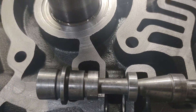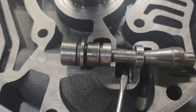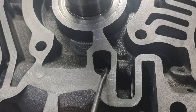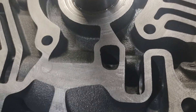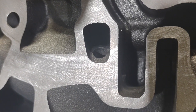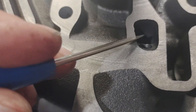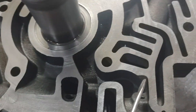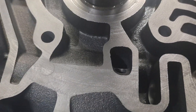What I want to show here is this is your line pressure side. This port here is your converter charge. We call this a dual-stage regulator — it regulates pressure from the line pressure area there in the middle of the screen into this smaller port right here, which then goes into the pump and works its way up and on to a much more complicated circuit.